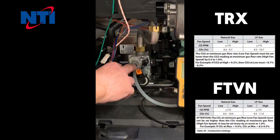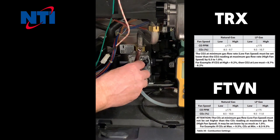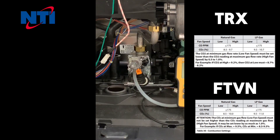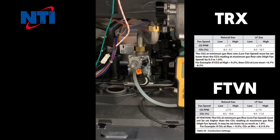If adjustment is required, small increments of perhaps a tenth or twelfth of a turn are all that is required on the low fire adjustment screw. A small counterclockwise adjustment will reduce your CO2; clockwise adjustments will increase it. Make small adjustments repeatedly as needed to get your CO2 in the acceptable range. The acceptable range for low fire is your high fire number minus as much as 0.3%, or equal to high fire. For example, if we had 10.3% at high fire, we would be allowed to have 10.0 to 10.3% at low fire. When making adjustments at low fire, ensure that you wait at least a full minute between adjustments before taking your next CO2 reading.